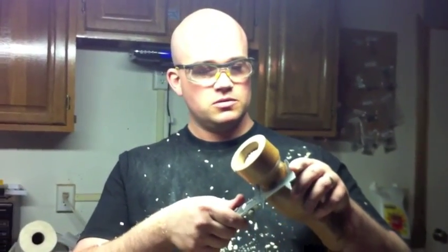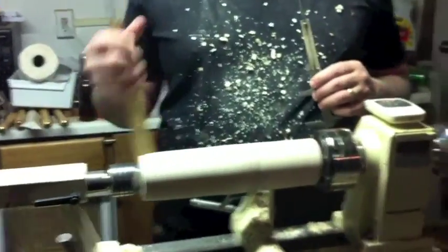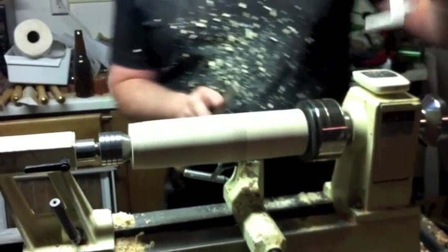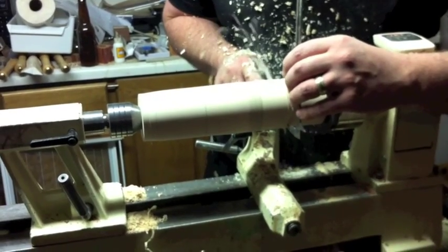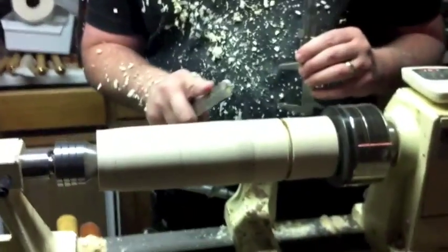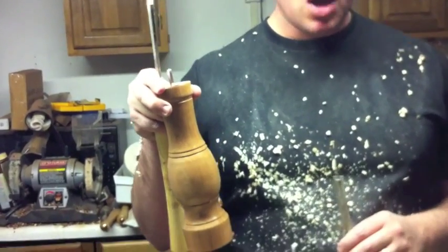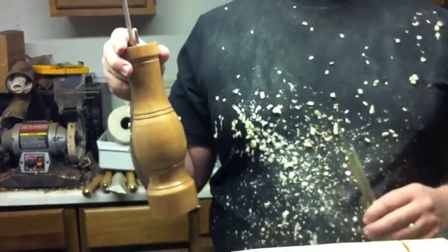Now let's take a look at the cove. I bring in my calipers, and again I go to my parting tool. I'm going to line that up right there on that center line I had made for the cove and start to cut a little groove with the parting tool. Put the calipers on there and let them work their way in. Now I'm going to do that in all the same spots — I'm going to measure on my model that I made earlier. I'm going to do that with the body, the neck, and right up there with the very top. Once I have all those critical areas measured, I'll go ahead and start using my roughing and detail gouges and really start giving this blank the shape of a pepper mill.